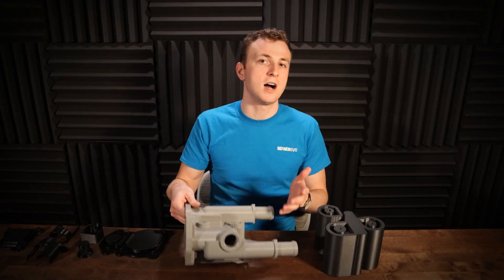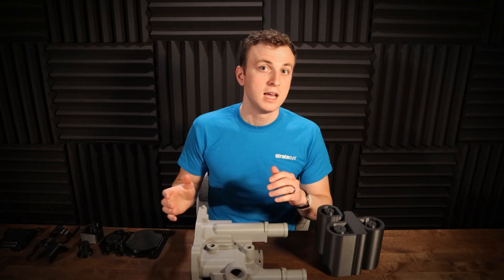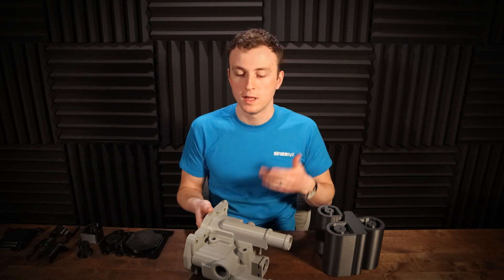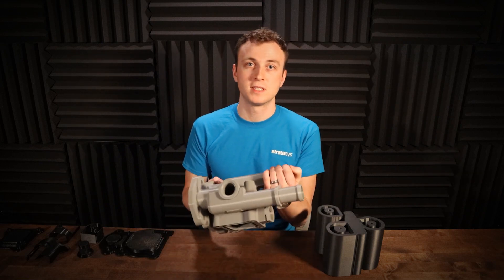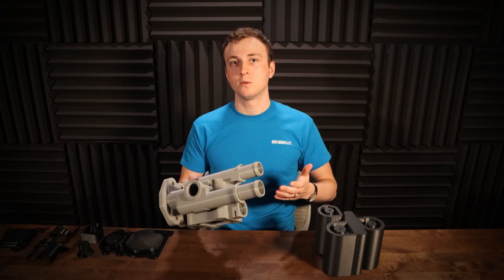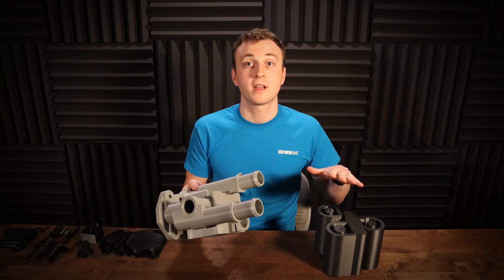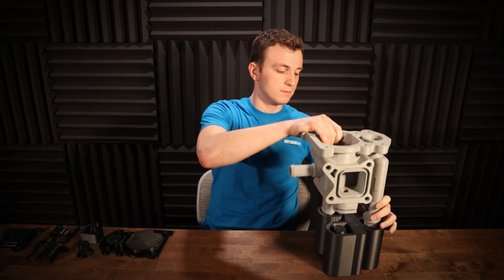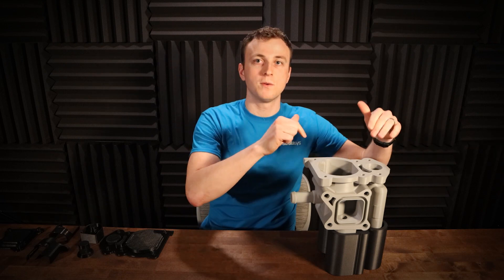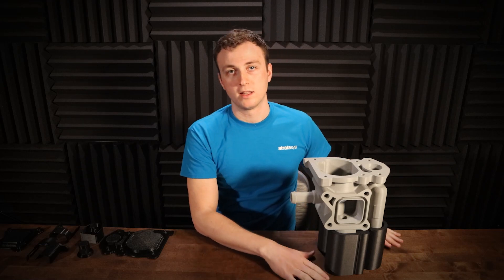Castings are often expensive to manufacture, and it's common to repair or remanufacture a casting rather than to replace it. It takes a lot of fixturing to remanufacture parts. For example, when a casting first arrives at a remanufacturing facility, it'll need to be stored before we can do anything else. The assembly fixture module is great for this — we can easily create quick holding fixtures to make sure our castings can be staged for operation, protected from falls, and held in a useful way for later operations. You can even add bolt holes or standoffs to secure delicate parts.